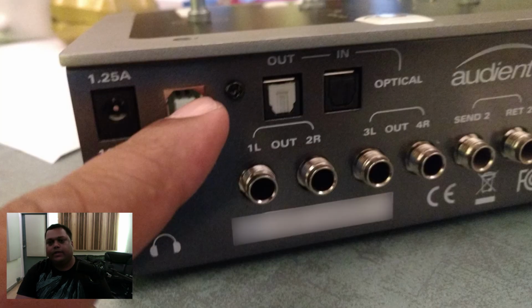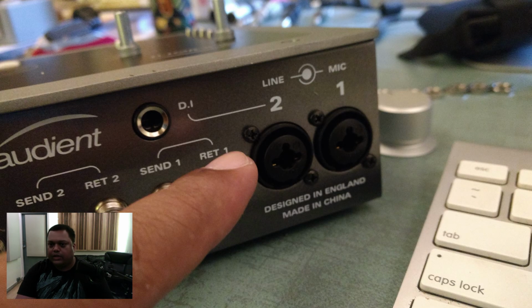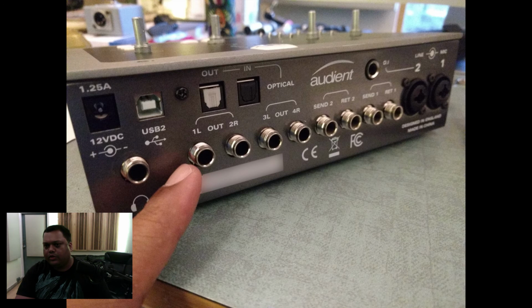Okay, so once that is done, you go on to the rear panel. Now on the rear panel, there are these 5 Phillips head screws, black colored ones, as you can see over here. Get them out first, followed by all the nuts and washers on all the individual connectors. Once they are out, the top panel should slide out comfortably. It's very easy to slide it out once all these screws are out. You shouldn't feel any great resistance, so try and nudge it out of the box.